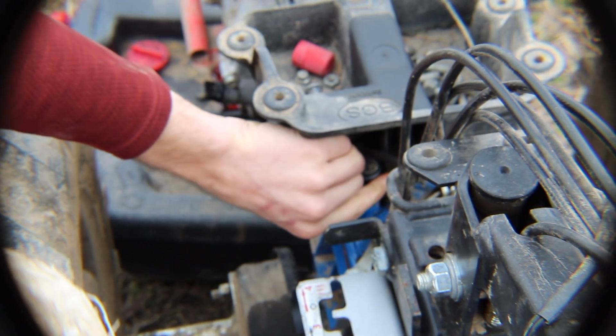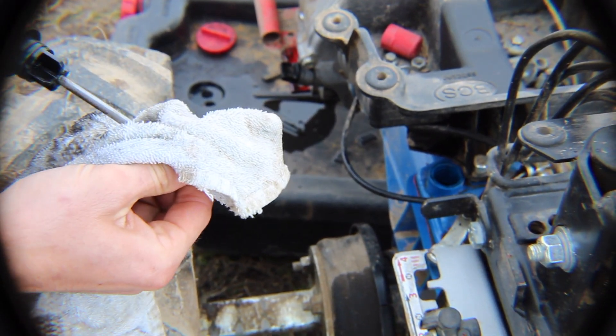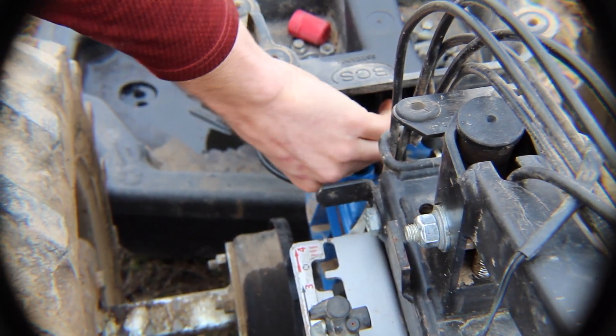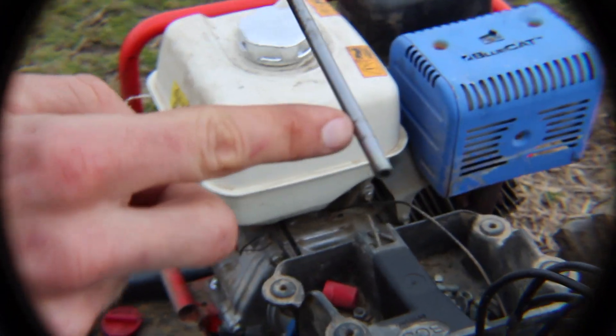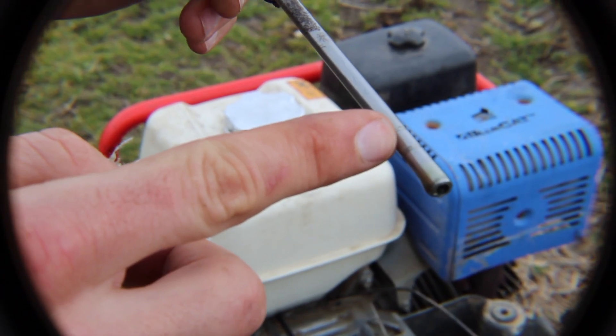This is a reduction case oil, which is a version with a dipstick. You want to wipe off the dipstick with a clean rag, put it all the way in and remove it again. And if the oil is between these two lines, you have enough. Looks like we don't quite have enough in there.